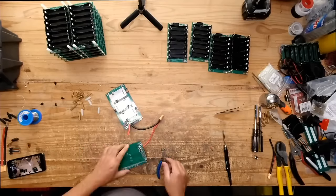So I get that question quite a lot from a lot of people. It's like, hey, these BMSs are not good because they're on when they're not supposed to be on. But like I said, it's not real voltage. It's just leakage voltage. And you know by connecting a load to it. If it can power it, then yeah, those BMSs are on. But if they can't power it, then it's not. So that's just one of those things: your multimeter is too sensitive when it comes to testing the switch, if it's on or off. It just shows that it's on, when it's not on, it's off, right?